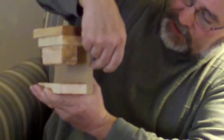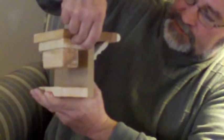Now, here is the basic layout structure of what you see on the wall. We started with placing a 2x2 support strut all the way across the wall to give good solid support for the hearth for any weight that might be applied to the hearth. Then we boxed in with basic pine material, 1x6 and two 1x3 boards, pine as well, and made these boxes up and then placed them over the 2x2 that's been screwed into the timbers to hold it secure.